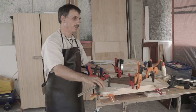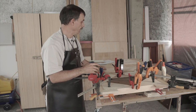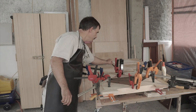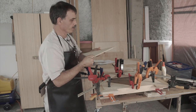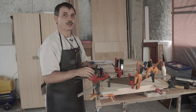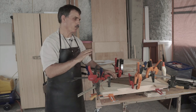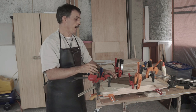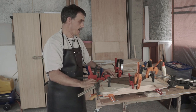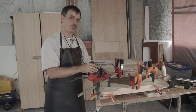Okay, so this is how it looks when I'm finished — clamps everywhere. I'll wait until it completely sets up before I take it apart, and then I've still got my long one to assemble. I actually cut one of these when I trimmed the corners off — one of them was still a little bit too long. I had to run over to the bench, cut it off with a handsaw, come back and glue it in. Just make sure that before you glue them in, they're actually cut to the right size. So when this is dried up, we will continue with the finishing process. I may put that into a separate video — exactly how I finish the edges and paint it — we'll see how long this video is to start with. Thanks for watching, we will see you in the next video.